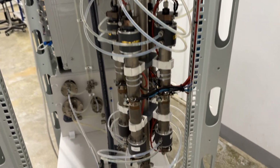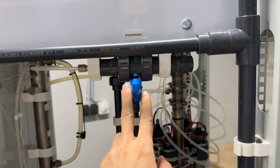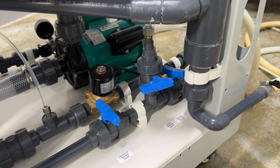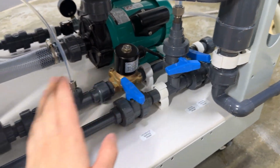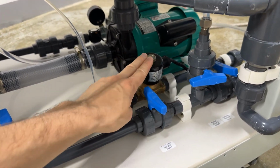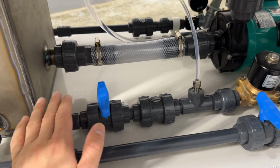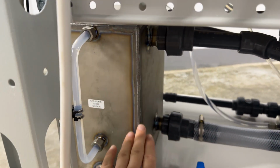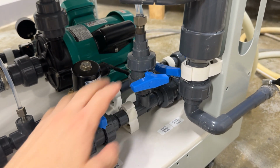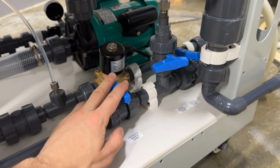And the main electrochemical cells. This valve serves only for service when we need to drain the anode chamber. In the working mode, it is closed. And here we also see valves, which should all be closed. They are also for service. For example, this one is opened only for the first startup of the device, when we need to quickly fill the whole tank with catalyst. And these three valves are used for drain. This valve drains the anode chamber and this valve drains the cathode chamber.